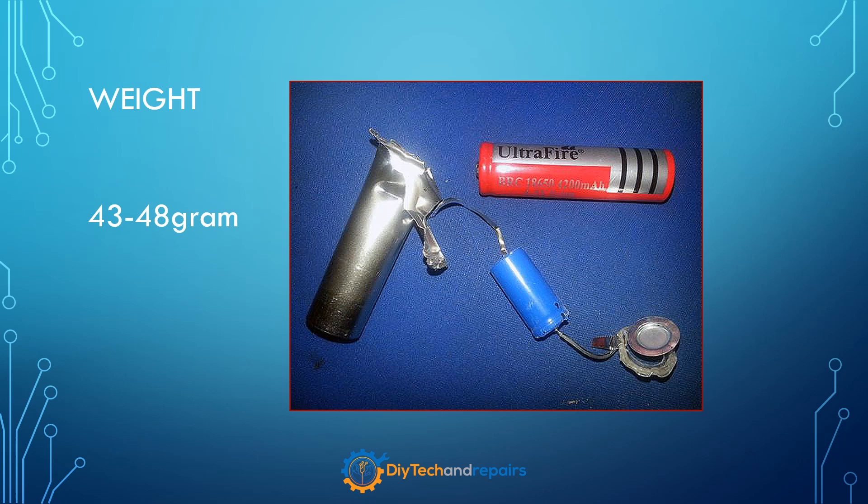Weight is also something that will tell you about what's inside. Unfortunately most sellers don't even point that out on the fake ones, and if you do not see the weight listed on the cell it actually is a fake cell. The proper weight is generally somewhere between 43 and 48 grams on an 18650 cell. Some cells with built-in protection may go up to 50 grams. There are cells out there that lie about the weight too — the example shown is a fake cell based on a smaller battery inside and thus not containing what it should.